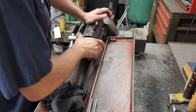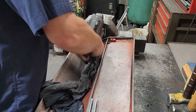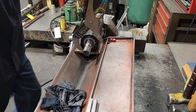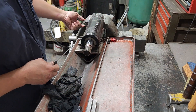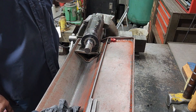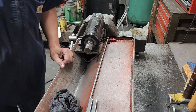We'll slide the gland forward - let's see if we can turn it by hand first. Get a rag for traction, use our big channel locks, tighten her down. These have o-ring face fittings on them, so we'll pull the o-rings out of those, put new ones in, and this one's done. If you liked what you saw, go down there, click subscribe, turn the bell on for notifications, and give this video a thumbs up if you enjoyed it. That's going to do it for this one, thanks for watching.